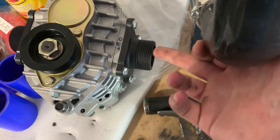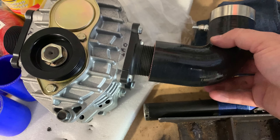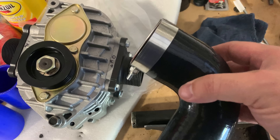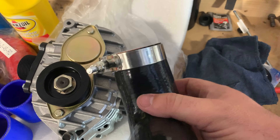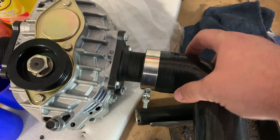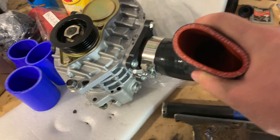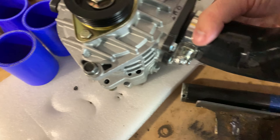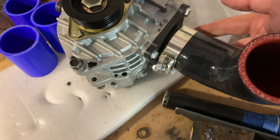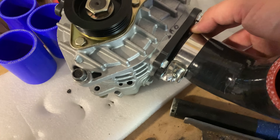The inlet and outlet on this thing are a little smaller than two inches. This is a two-inch coupling, and you can see it kind of dances on there a little bit. So I went ahead and put a band on here and started tightening it up, and you can see that it's brought it in some — now it actually does have a little bit of drag to it, so it looks like it will tighten up. So two-inch in and out should be good; it'll tighten down with a band clamp. You want to get the higher quality band clamps because there's no way a regular hose clamp would pull down this tight.